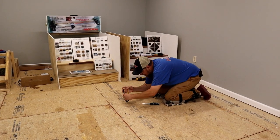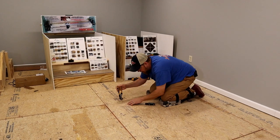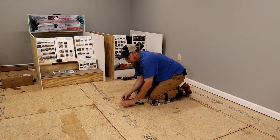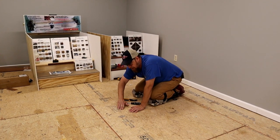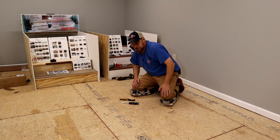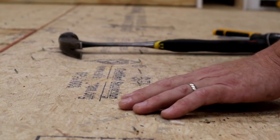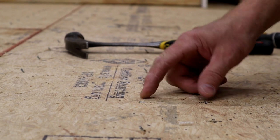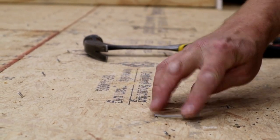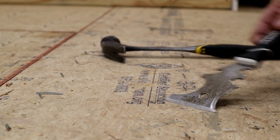The main thing you don't want to do is beat these staples down and leave them in the floor. You always want to either remove them or at least get them knocked down flush. If you try beating them down, you can still catch them because it's hard to get that piece of staple beat all the way in. I'll show you right now — I'm going to beat this down and see how it does. Yeah, you can still feel it a little bit. With the staple laying flat it's hard to beat it enough where it sinks into the wood. See — still sticking up no matter how much you beat on it.